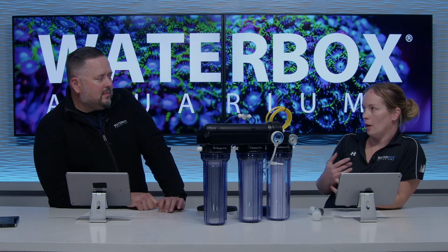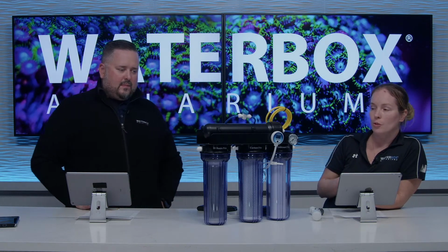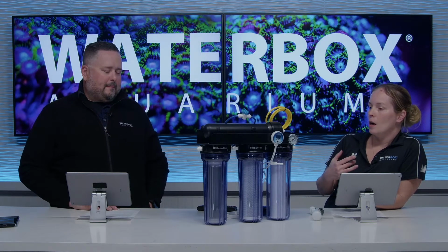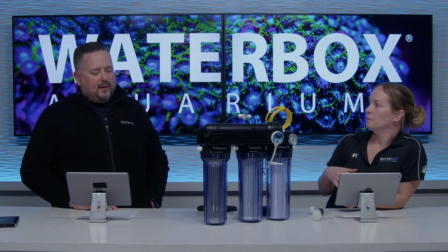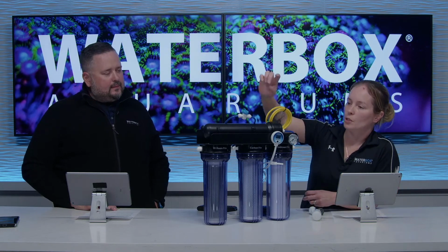If you're just in a low pressure area and yours is coming out at 40 or even less, get a booster pump. It's just going to be better for your long-term filter usage. So not everyone has super good water pressure. Right. Next one, we'll talk about TDS in a minute.